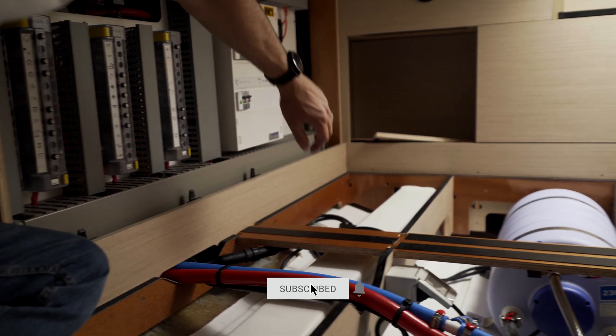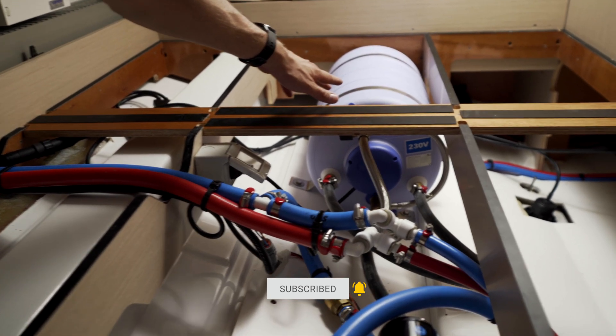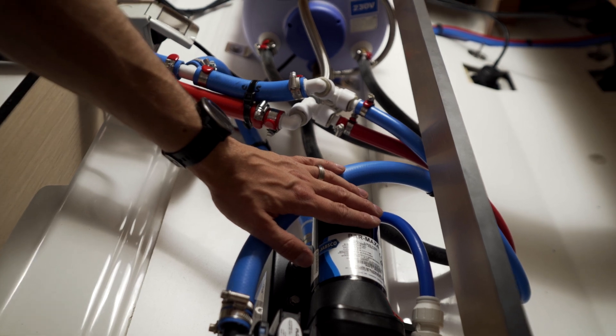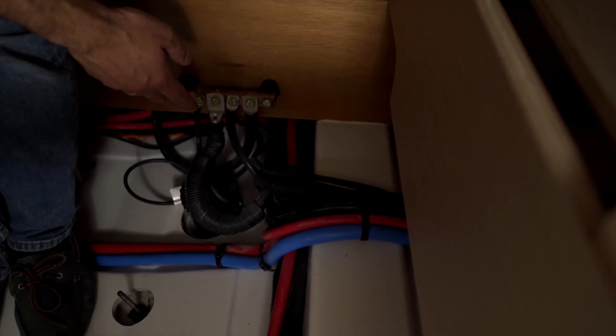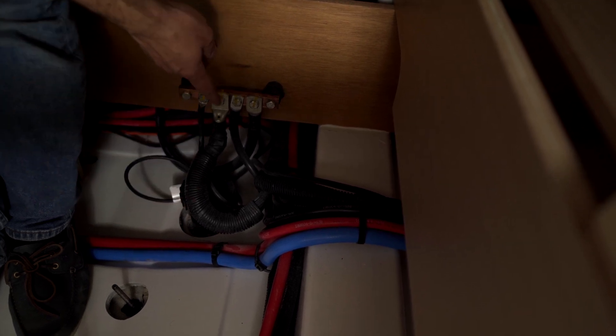Next, we need to find a suitable installation location for our Raymarine EV1 course sensor. This should be placed at least one meter away from any large live lines and equipment such as boilers and pumps. Also, make sure that there are no other components such as bus bars or sonar sensors close to where it is to be installed.